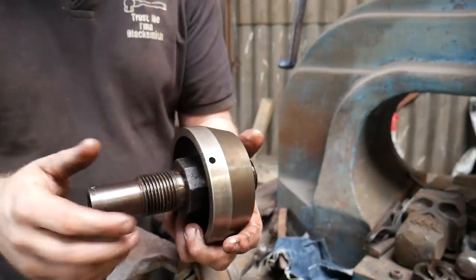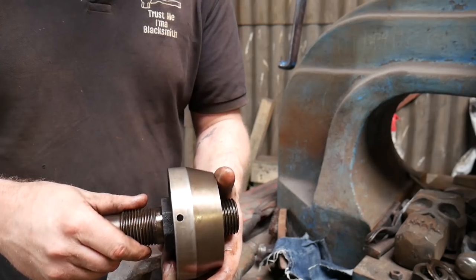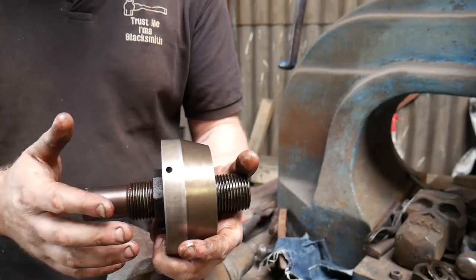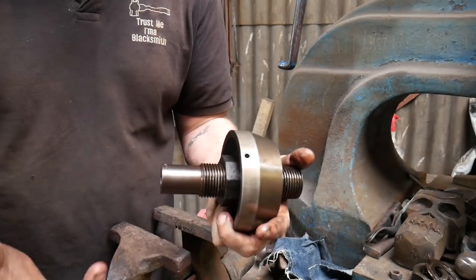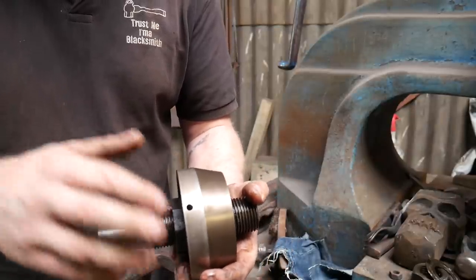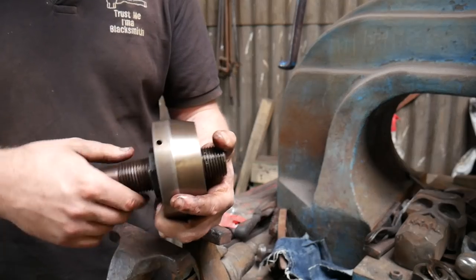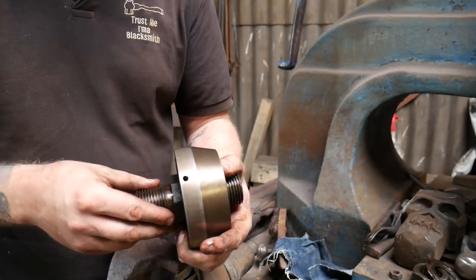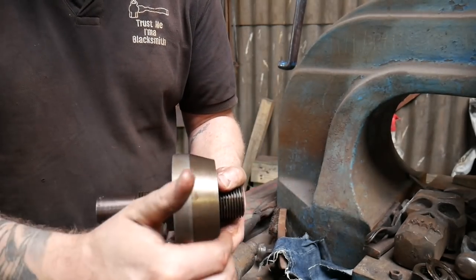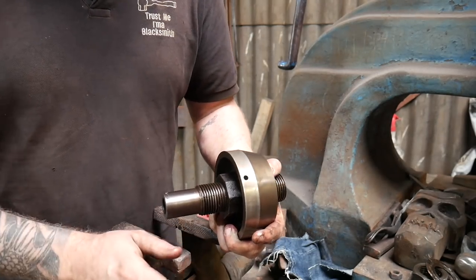Okay. This is the valve that we're adjusting, and there's two nuts either side, and the location of the nuts depends on the position of this inside the main valve. What I've done, it was too low, it was set to nothing. I don't know what the setting was before, but what we did on John's advice was put it to zero, so it was flush with the top of the valve. He said, if that doesn't improve it, put it higher. So we'll do that next. We're going to try and run it so that it's higher, 3 mil above the top of the valve. And if that doesn't sort it, we'll drop it lower. Then I'll pick which one seems to perform the best, and we'll go from there.